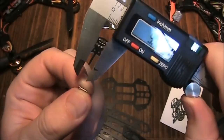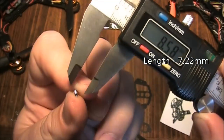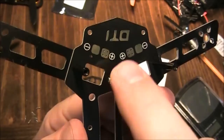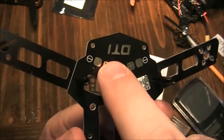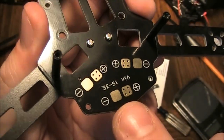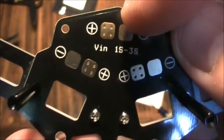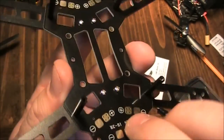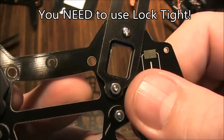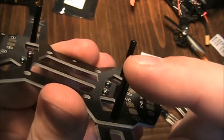Here's one of the screws included. The length is 7.22 millimeters and the diameter is 1.90 millimeters. Here's the frame partially assembled. Up front where the DTI logo is - that's the front of the frame - is where you'd solder on your ESCs. Back here on the back is where you'd solder on your battery cables and ESCs. You can see it says it supports 1S to 3S, so you can run 3S batteries on this.